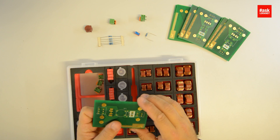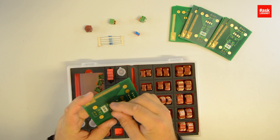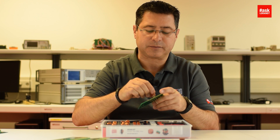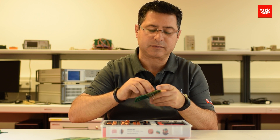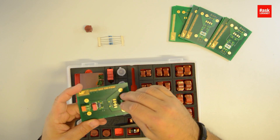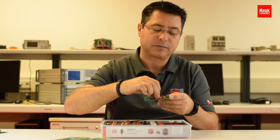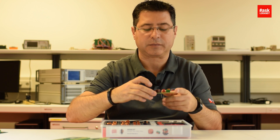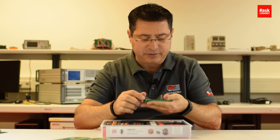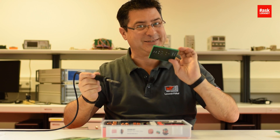Take the PCB and mount the components. I will put first the resistor because this is the smallest one. The next one will be the X-2 cap. Then the connector — two-pole, three-pole. Then the common choke. I will not put the Y-caps now because I don't have a pick-and-place machine here, just a soldering iron. Then take the soldering iron and solder it.